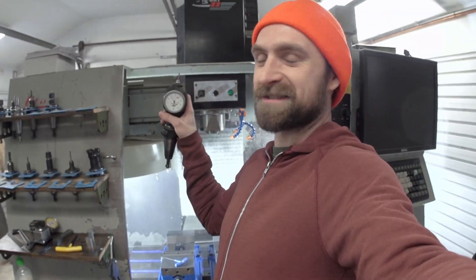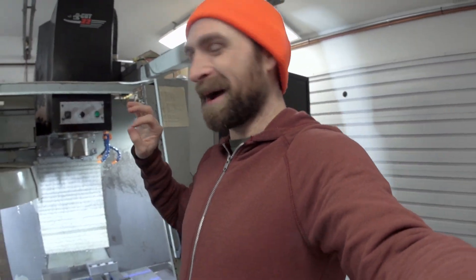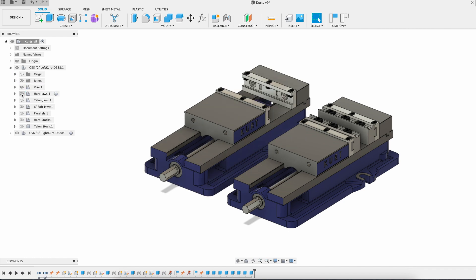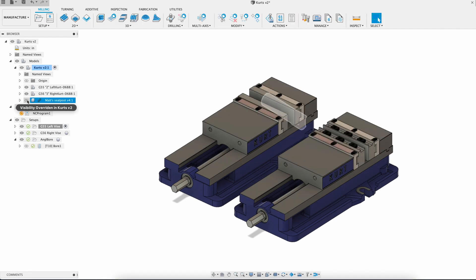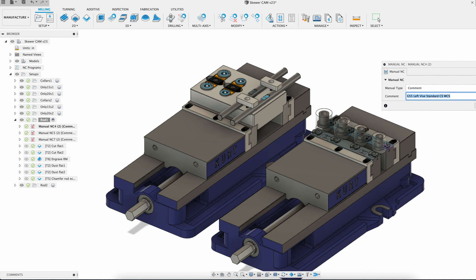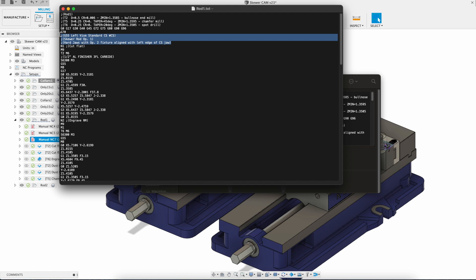When I'm creating machining programs, I can drop the part right into the modeled vices in the computer, which reference the G55 and G56 coordinate systems that are now consistent because I'm not going to remove these Carve Smart jaws. I very rarely even use the indicator anymore. As long as the jaws are in the right spot — which I can note in my programs — I'm good to go. I can model my vices, swap out whatever jaws I have, drop my parts right in, and note the location and size of stock in the programs. It makes setups much easier and I don't have to constantly reset my XYZ zero location.